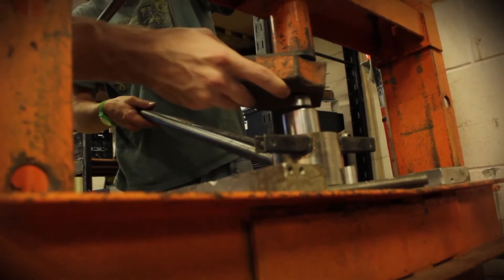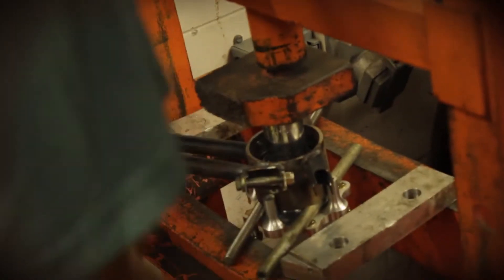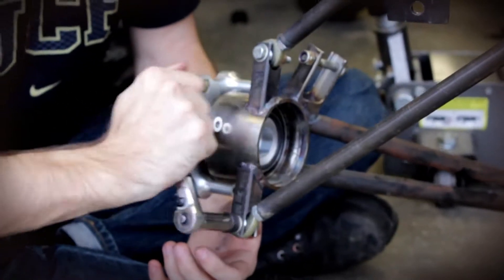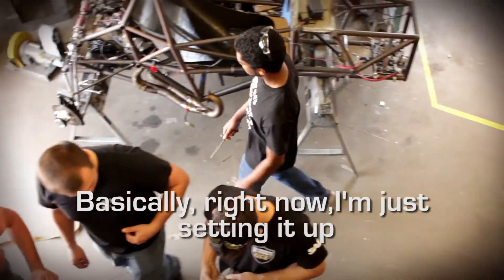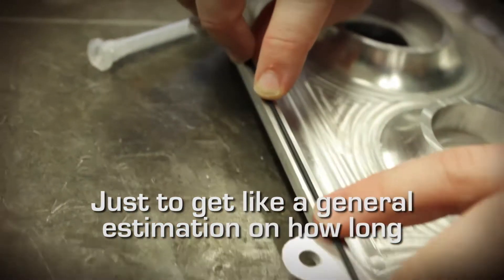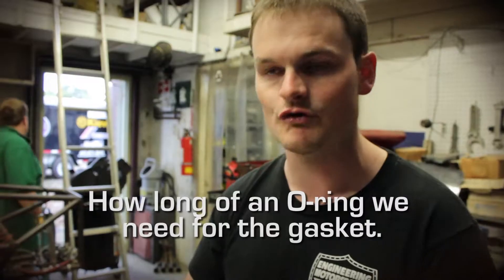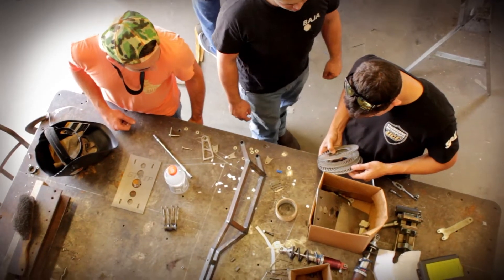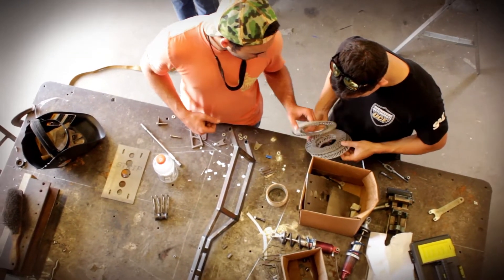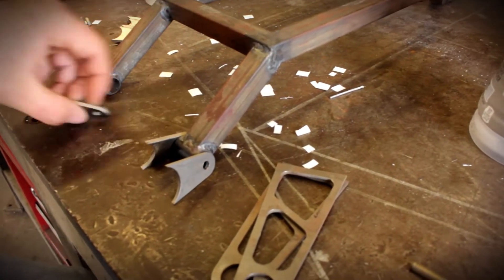So what is it you guys are doing? Just taking the hubs off — sending them to some shop to get worked on. Right now I'm just setting it up and thinking through a general estimation on how long a ring we need for the gasket. Before you weld everything, you want to jig it all up, which basically means make a bunch of fixture things to hold it all in position so when you weld it, it doesn't walk.